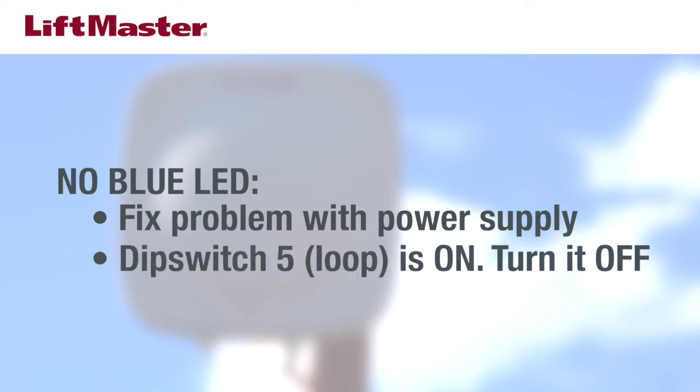First, verify that the reader is acknowledging the tag by holding it in range of the reader. If the reader doesn't acknowledge the card, the problem is likely to be either no power or low power, or dip switch number 5, labeled Loop, is in the on position. Check your power supply function, wire type, and distance between the power supply and reader, and fix the problem as needed. If the dip switch setting is the issue, turn dip switch number 5, labeled Loop, off.